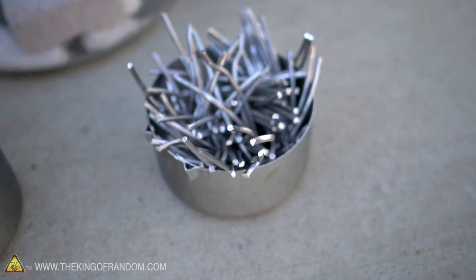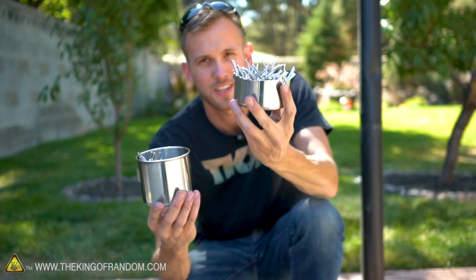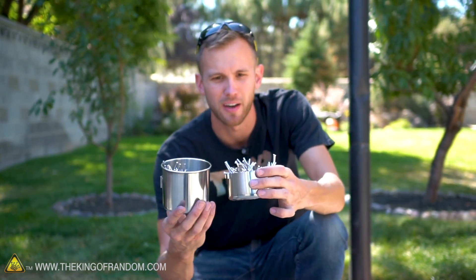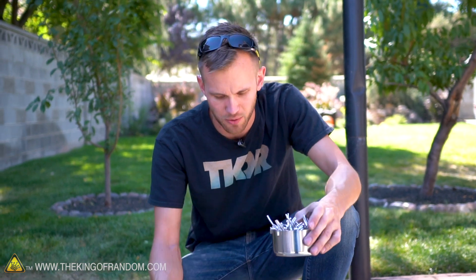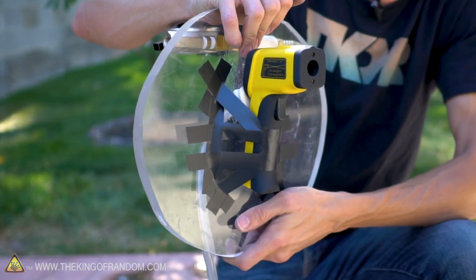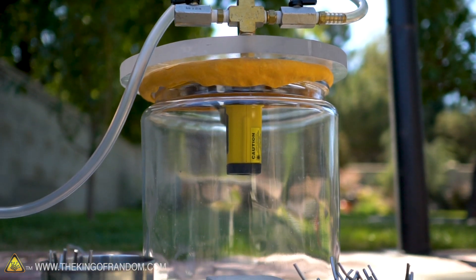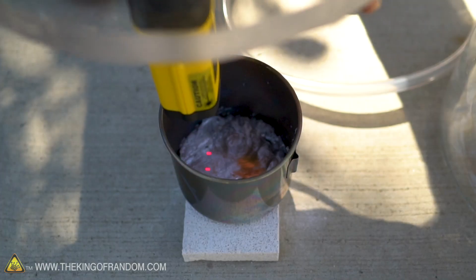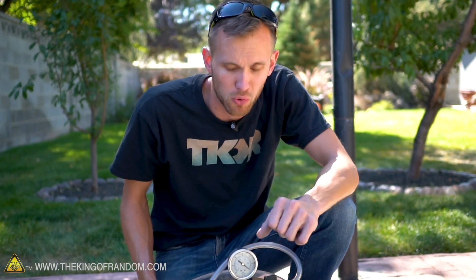We've got these two steel cups and we're going to put them into our furnace and melt down the aluminum inside. They started off as the same cup — we cut this one in half just so we can see inside it better. We want to watch what happens inside our vacuum chamber, and vision's going to be a little bit limited. On the lid of our vacuum chamber we have a digital thermometer that goes up to about 1900 degrees Fahrenheit, or just over 1000 degrees Celsius. We're going to tape that switch down so that as we pull out the vacuum, it gives us a constant readout of the temperature of the metal — hopefully showing us how fast or slow the metal cools down.